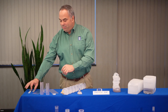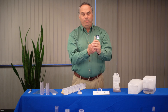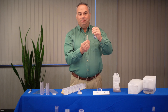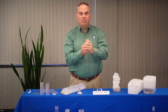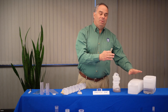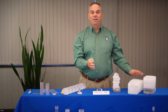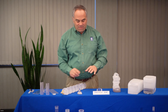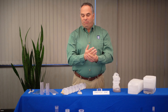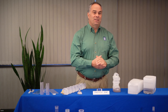In the case of the flame fusion process, in order for this process to make a boule that's actually workable, you typically have to add copious amounts of TiO2, or titanium. When you add that TiO2, that material is machinable and it doesn't fracture, but this can also be the source of supply for the sapphire for the HEM process, and you would end up with pink boules. Pink boules — the TiO2 will restrict the ultraviolet transmission down in the 200 to 300 nanometer range. So all of these materials are selected based upon the end-use application, so anything that can be given to us with regards to what it's being used for can be critical in assuring the success of sapphire in the end-use application.